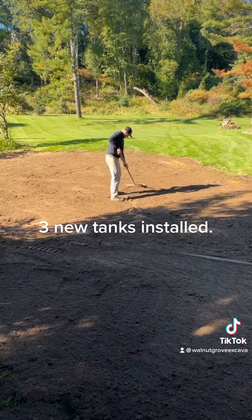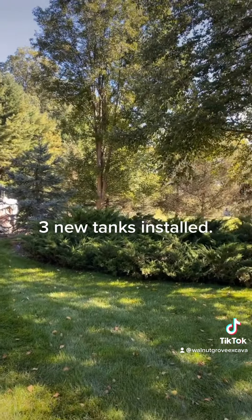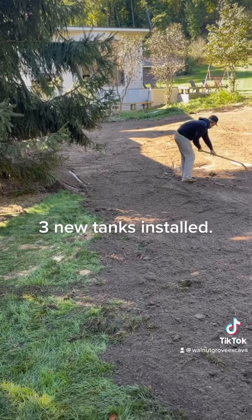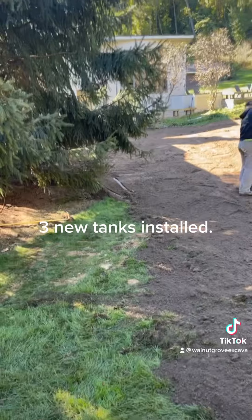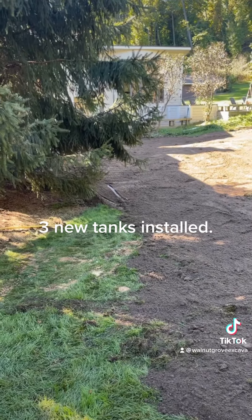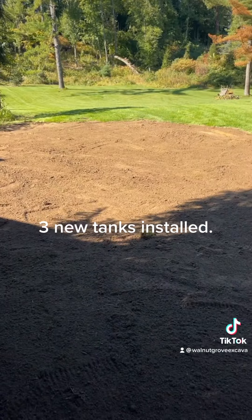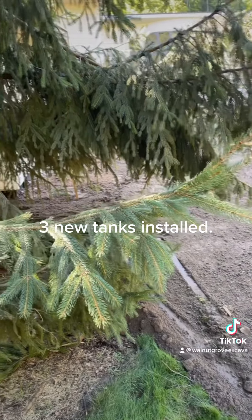It's been a busy morning — Ethan, Calvin, and Chuck. This was the tank replacement we were on yesterday. We finally got the lines blown out in the drain field, did the pressure test, and it passed. Yesterday when we pulled the old pump out, the rope was up inside it, meaning the pump was bad and nobody knew it. There was also a diverter paddle that was leaking out to an old drain field. We ended up getting a new pump — Len picked that up late last night and got it here this morning. We always hardwire everything in and have an electrician do that, but this one actually had a 220 plug on the side of the house. The problem is the cord doesn't reach, so we spent the morning trying to find extension cords until the electrician can get here, which we were unsuccessful at. We're going to see if he can get over here a little bit earlier.